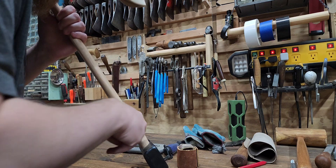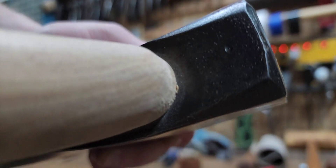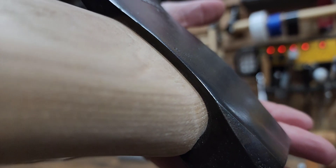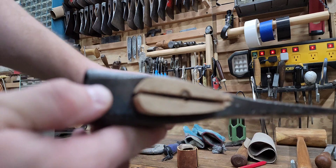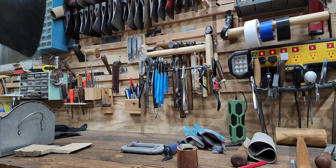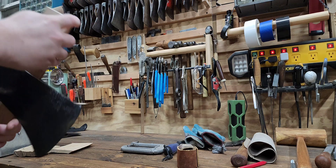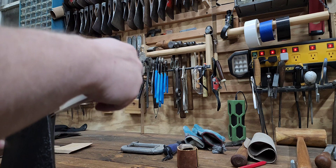If you're listening, you can hear it when that pitch changes — when we kind of stop making progress. Hopefully get a little better lighting. That's the only bit of curling I've got, but it's a super tight fit all the way around, which is good. Got some room in the eye — that's also good. Get this wedge in there and start driving it. I do have it marked where the full depth of the kerf is, so hopefully we'll get some decent depth on it.